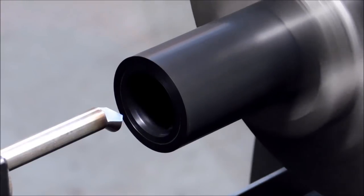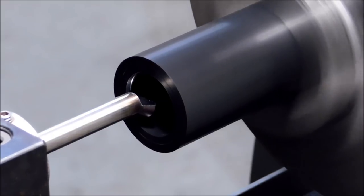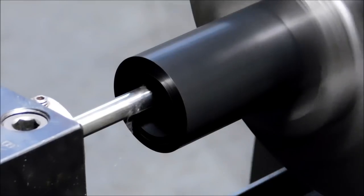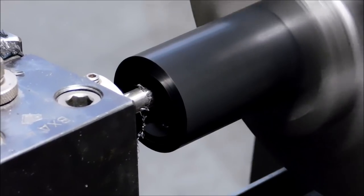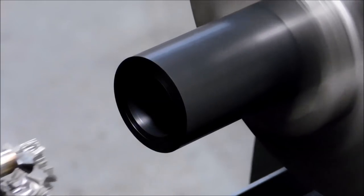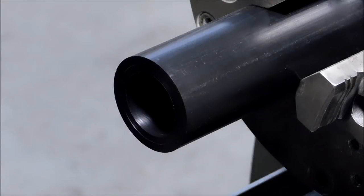If the thickness of your material is still sufficiently thick as to avoid distortion or push from the tool, it's okay to take a second pass. The majority of this technique is going to work on the OD. Go for the 2-inch length. All right, now the OD is going to be done in one shot. That way the bushing has the support from the main body of the material that's currently there.